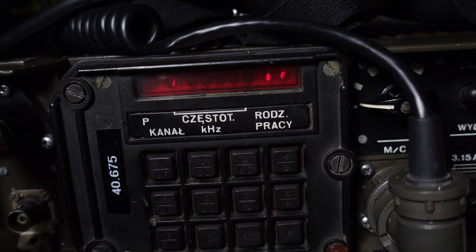We've got low power, high power, squelch disable, and squelch enable. That setting is global for all your channels. So I can go back to the channel selector, go to channel one — retuned to channel one — and we can hear the squelch being open because something is going on on that frequency. If we jump to channel two — quiet. Channel three — quiet. Channel four — quiet. Channel one — there is something going on. So as you can see, squelch is a global setting for all your channels, as is the power level and the mode of operation. If you've got anything other than the expected letters, that means you accidentally pressed something from those modes and you have to go and press number one — that is the standard local mode of operation from the headset.